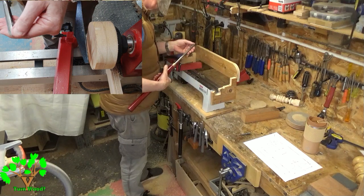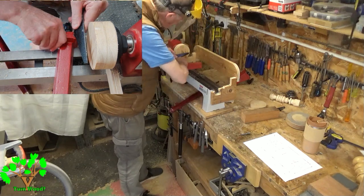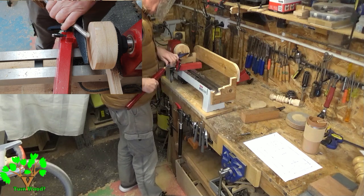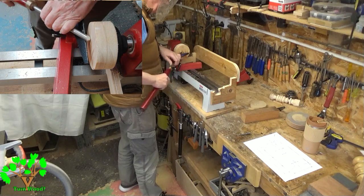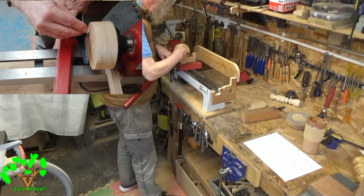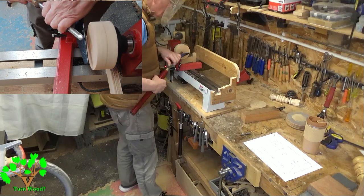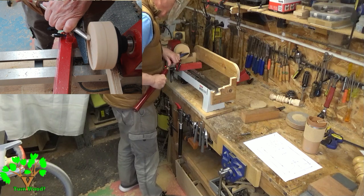Get it roughly the bottom edge of the cutting edge of the flute. Get it roughly on centre. And then we'll just lean back. We'll use the top edge as a guide, so about 1/2 millimetre gap. If we come out like that, we'll take big cuts. But if we leave a gap that's parallel to the direction of cut of about 1 millimetre or 1/2 millimetre, we don't actually touch that on the wood, we only cut with the bottom edge. And then I lean back now. You see that means it's not running through yet.